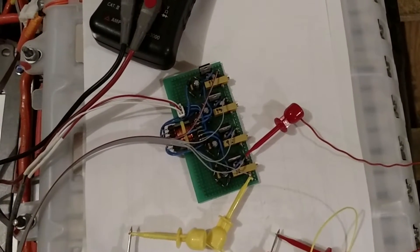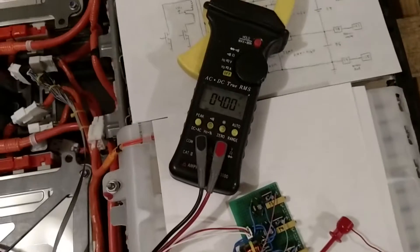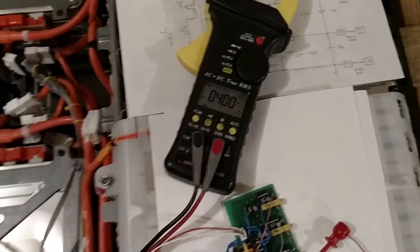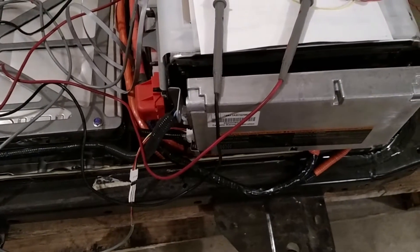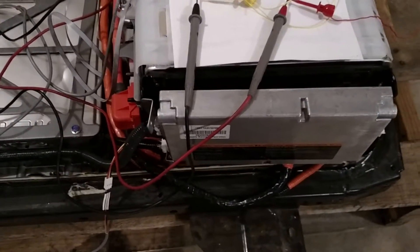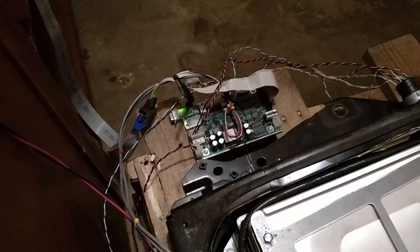It's four isolated supplies that are variable between 2 and 4.6 volts, and with a little 20-turn pot I can change it. I've got the voltmeter on there, putting out about 3.99 volts, toggling between the two. I've still got CAN bus hooked up, and a serial cable hooked up to the receive line on the microcontroller, so I can sniff the communications between the battery management balancing chips that measure the cell voltages and do the balancing. That serial cable runs over here — CAN bus comes out of that connector back there, serial cable gets plugged in over here and goes to the DMOC adapter, which is running code to collect all the data and ship it over Wi-Fi to my browser.